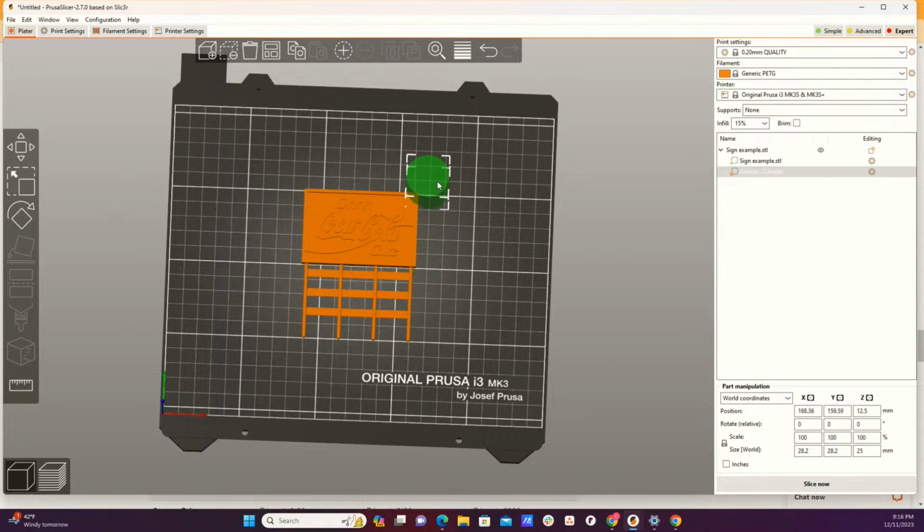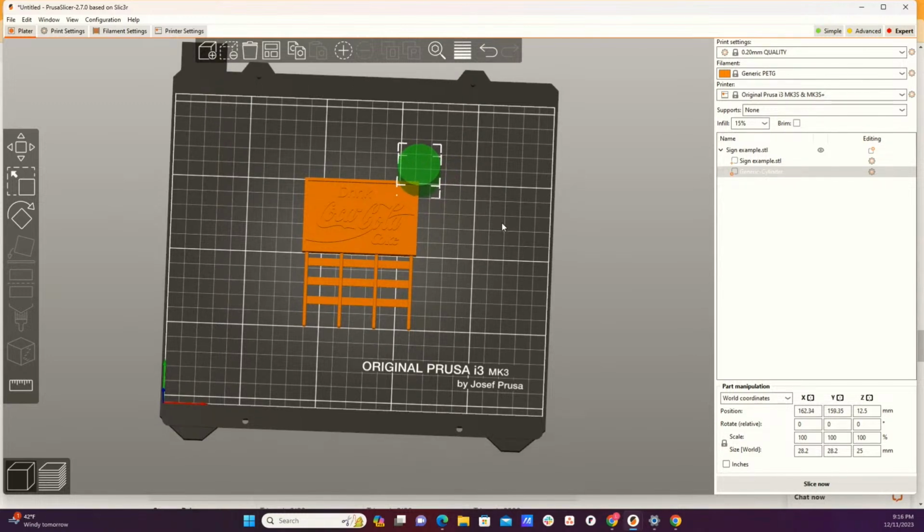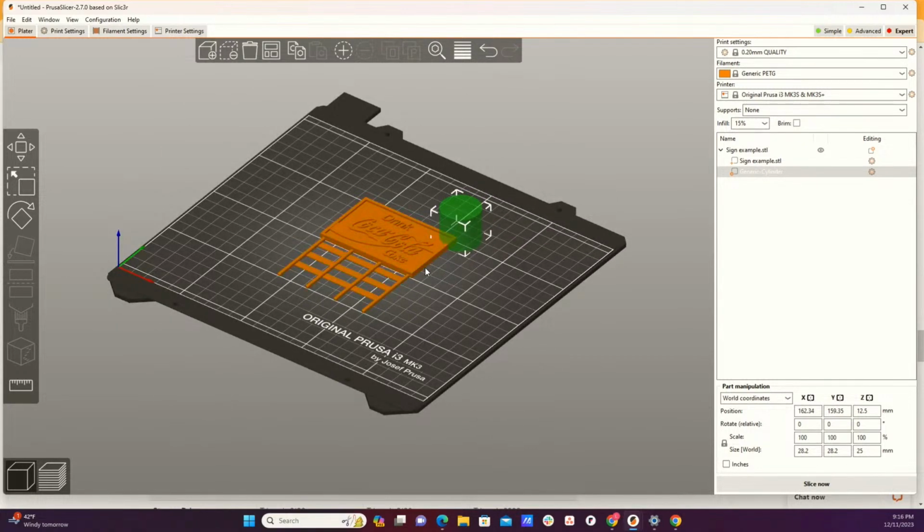So one thing you could do, if you know specifically what you're having the issue with: the brim goes all around the model, right? It's going to go all around the outside, and then you have to pull that brim off, and it's going to leave a discolored mark. Black is the easiest example. If you're using a matte black to print this, it'll leave a white stress mark on the plastic once you've peeled it off. Now, one thing you can do to make that go away: heat guns. Heat guns for 3D printing are wonderful, or torches. If you can heat the plastic up a little bit, the ABS, or whatever plastic you're using, if it's black, it will regain its color after you've melted it.